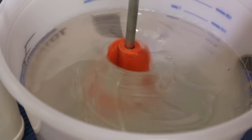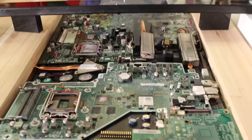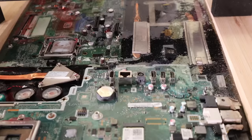And with everything in its final place, it was finally time for us to break out TotalBoat's newest product, Thick Set Fathom, which is their really thick pour resin. So you can do up to 2 inches on a gigantic table with this and it doesn't overheat. Ready? Yeah. I'm not. The downside is that it can take 3 to 10 days to cure. And so you have to do a little bit of advanced planning, which is not my forte.